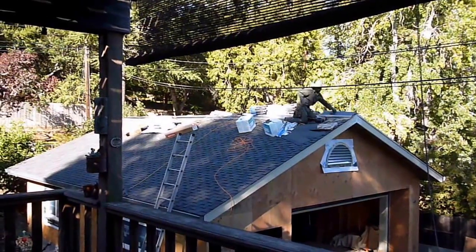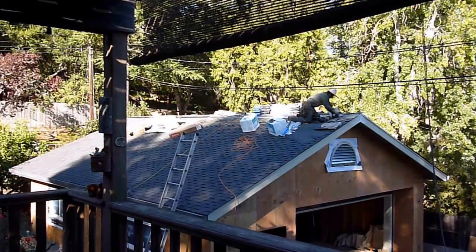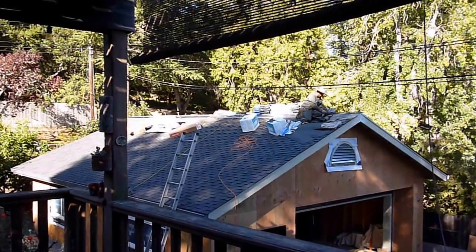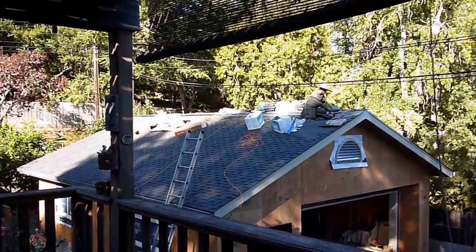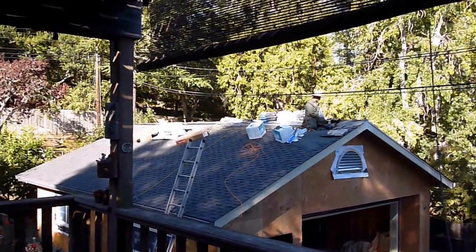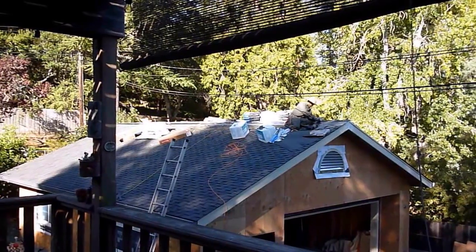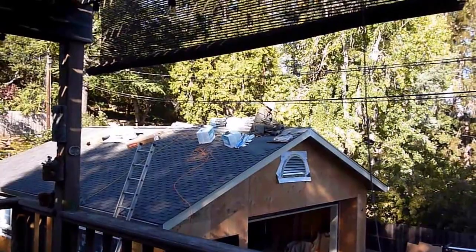Anyway, the bottom of this roof gets sheetrock, so in order for it to vent, circulate air, he's putting a vent at the top of the ridge, and it's got vents at the bottom of each of the rafter bays too, so it can circulate air. He's almost done with this side. Not a fun job for sure. Anyway.